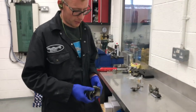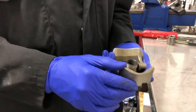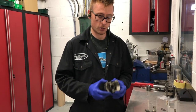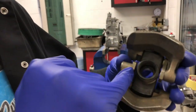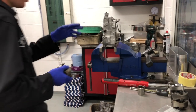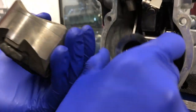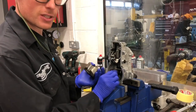Here we have the flyweight assembly for the Governor. Basically how it works — obviously it's centrifugal. As it spins faster, the centrifugal force pushes the weights out, and it actually forces these two small levers out onto — this is a Governor assembly — it pushes them out onto this. Now, this has a bearing on the back of it, and it acts against the whole system inside the Governor.